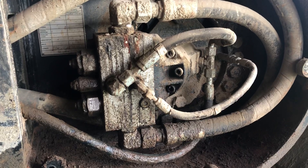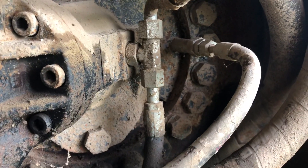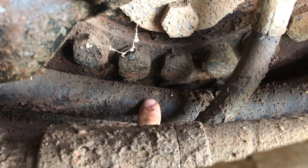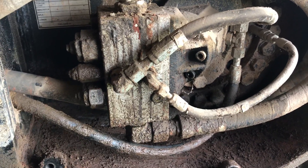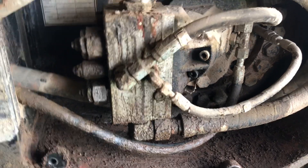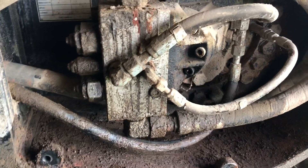It's not rocket science to find the probable source before you actually go to the point of running the machine to test for it. We can clearly see at the top there's no leaks there, back here it's dry. When you look for leaks on hoses you have to think about when that hose pressures up it moves. Depending on how it's held captive, it might slide, curve more, or relax more — so think about what's going on when the operator is applying whatever control you're looking for the leak on.